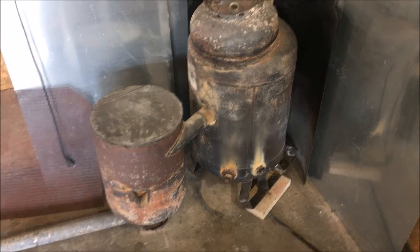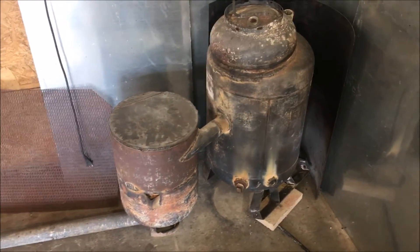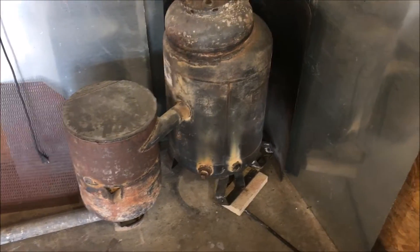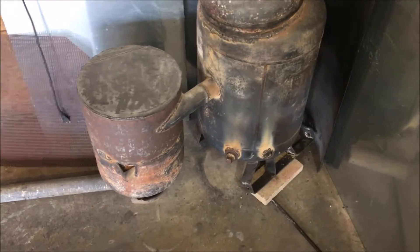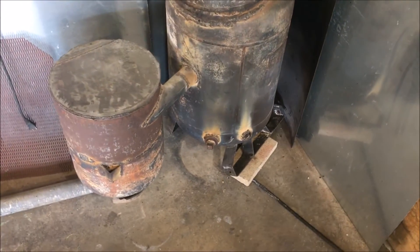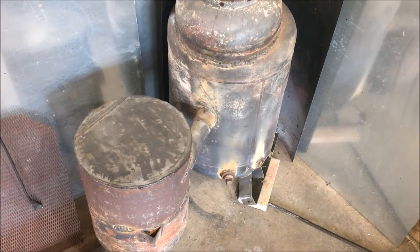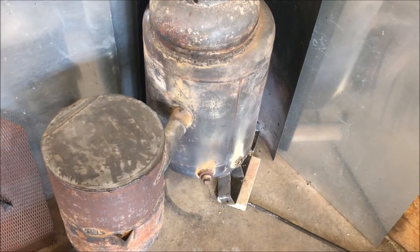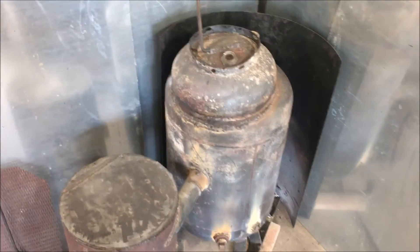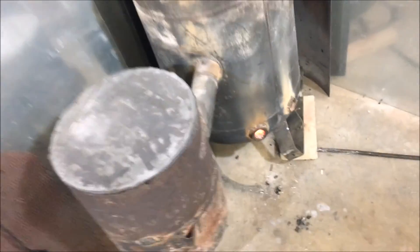In conclusion, basically what it comes down to is you want to use a vacuum pump to run one of these wood burners and not a blower converted into a vacuum — they just don't pull air well and you'll start getting a back draft effect and pulse jet engine behavior. I've had mine for six years. I do have to clean it out every year, but it's better than chopping firewood 50 to 60 times a year. I'd rather clean the blower. Just use motor oil and it will cut right through that creosote tar. Used motor oil is what I find works best — I'm not sure what's in the used motor oil that makes it better, maybe a little gas or something.